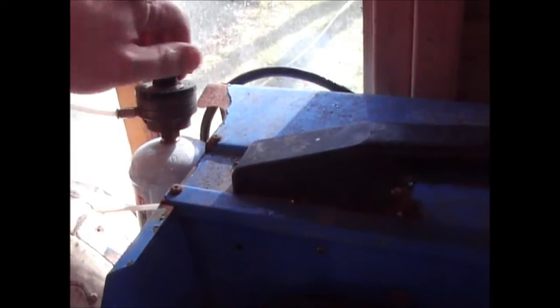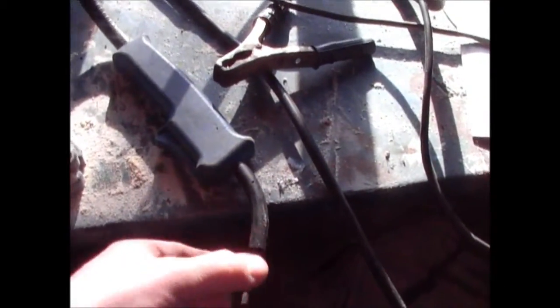You don't need the gas to be very fast. This is a mistake that most people make. All you need is a little teeny bit of gas, because what you're doing is creating an inert cloud around where your weld is, so you're not oxidising the steel.